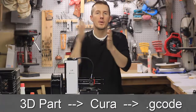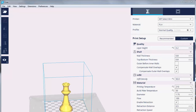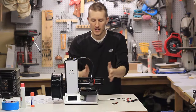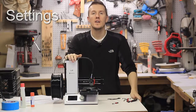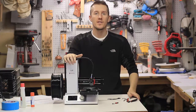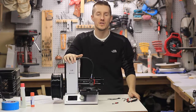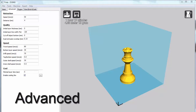You take this 3D part and you're imparting it with information — telling it how hot it needs to be, how fast it needs to go, whether you're extruding, how fast the first layer. That's where you're telling it all this information: where the print bed is, and you're placing that part on that print bed to tell it the coordinates. That's one of the huge things you have to learn — the settings. I found the original Cura that comes with this printer, version 15.04.06, is a really good one to start off with, because it's very simple and doesn't have a million settings — just the basic ones.